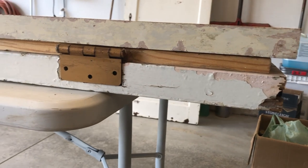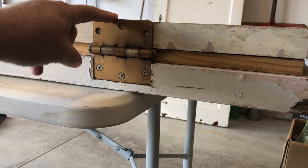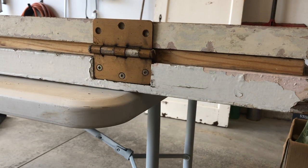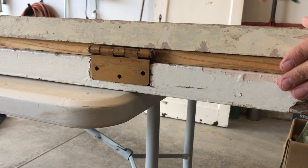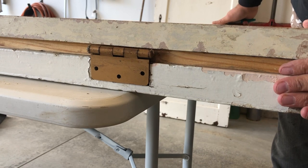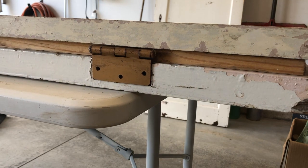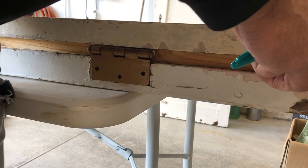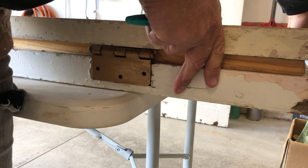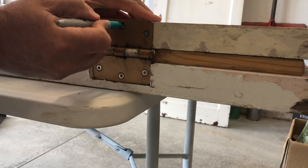Here I'm putting the first door onto the second door. I have a little piece of wood in there to make them the same height so the hinge lines up flush with the other door. You want to have the doors in position with something — a piece of wood, a book, even a stone — just to hold it straight. I'm squaring it up carefully because once I attach them, you don't really get a do-over without re-drilling and re-screwing. I'm getting the ends lined up perfectly, then flipping the hinge up and making three marks with my blue Sharpie. You're going to do this at both ends — a hinge on the top and a hinge on the bottom.